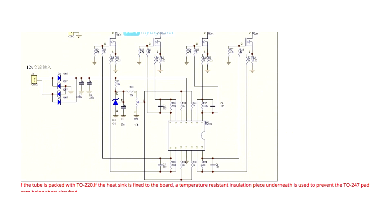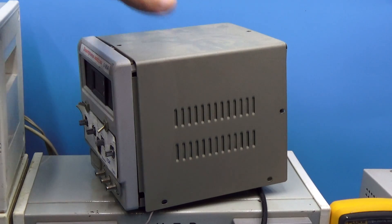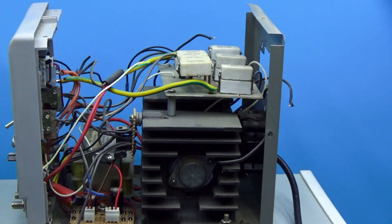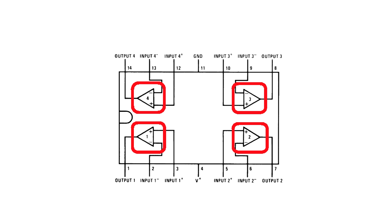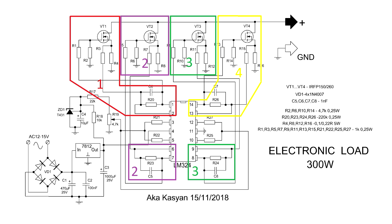But I prefer to make my own version. Finding the circuit of the device was not difficult. I have repeatedly shown a load working exactly according to this principle, and even made the device. Links to all videos can be found in the description. The circuit is also a powerful version due to the use of the LM324 operational amplifier chip, which consists of four separate elements. If you look closely at the circuit, it becomes immediately clear that it consists of four separate loads connected in parallel, so that the overall load capacity of the circuit is many times larger.